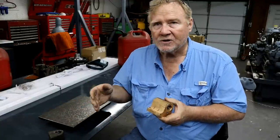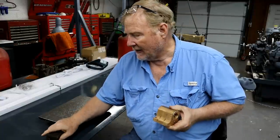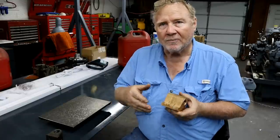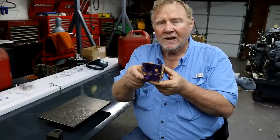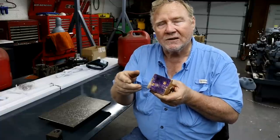The reason I'm doing that is this nut is hidden in this machine, and it's going to be a booger bear to put any kind of shim or anything behind it. You could put a shim to make it go farther away, but you can't bring it back towards the table if you need to. So I'm going to measure it so it's the same as this one, and that'll eliminate that need. Now, this motion is easily taken care of by the screws that go in the back here and hold it.